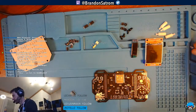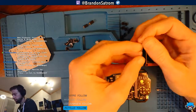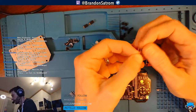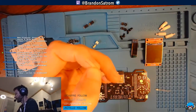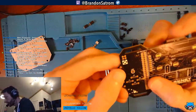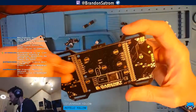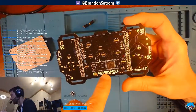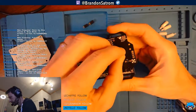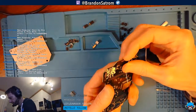We're going to do the easy part first — soldering in the LEDs. LED polarity is almost always long leg positive, short leg negative — anode positive, cathode negative. The silk screen doesn't explicitly tell us one way or the other, but I can see LED2 and LED3. Looking down at the front of the board with the Darknet logo on the bottom, the instructions say to ensure the cathode is toward the left. I'm bending the leads back so they sit nice and snug.